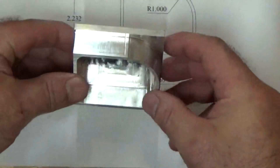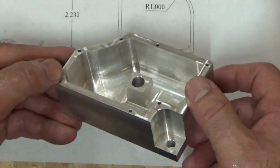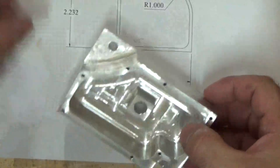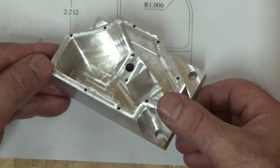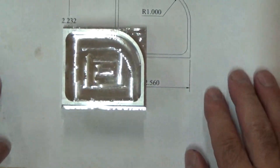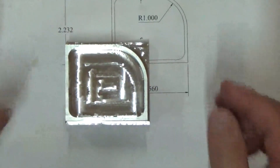100 on the nose and maybe one-oh-two — so dimensionally this thing is actually pretty good. Here's another one I did a little bit earlier, and it actually doesn't look as good as the second one, but it's still not half bad. I'm pretty happy with it. And here's some other examples of ones that I've done. This part here is not even a complete 90-degree arc — it's a little bit different. And this might be an example of one I did with a slightly bigger cutter — it actually looks pretty darn good. My deltas were probably smaller and/or the cutter might have been a little bigger. So anyway, that's how to cut an arc using the Cartesian display — and again, for a one-off or a prototype or just a short run of parts, you can do a pretty respectable job of cutting an arc. Okay, see you next time.